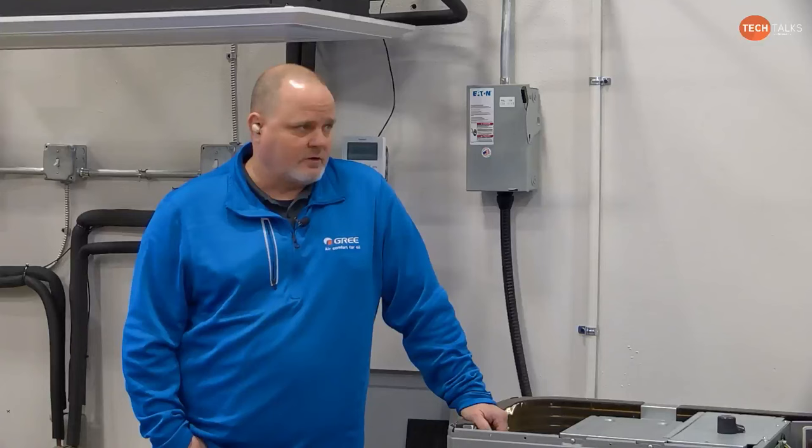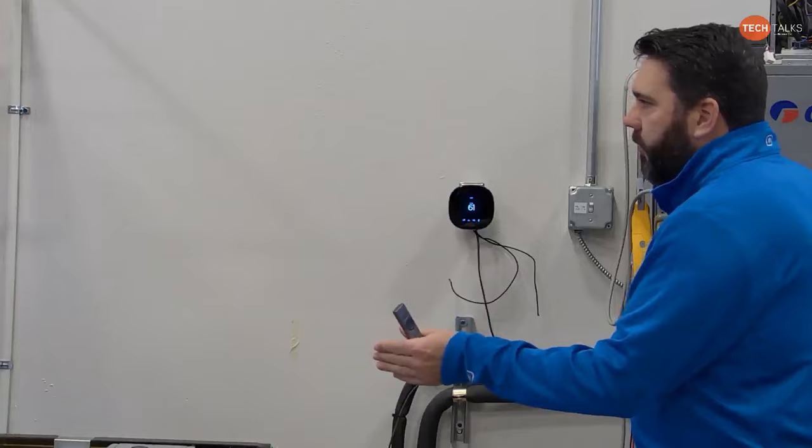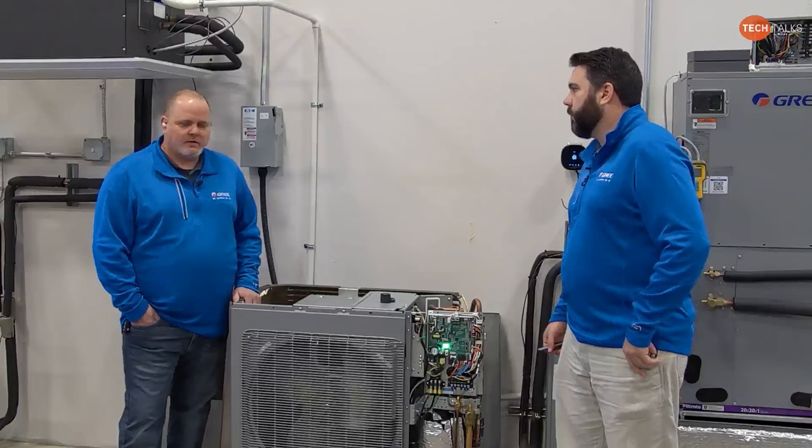That'll help with dehumidification. Yeah, that's a really good point. It'll force longer run times. You want to make sure that your blower is not running too fast as well. So you want to target that 325 versus 350. Make sure that your air is moving slower. I don't even care if it goes down a little. I say 325, but even if you got down around 315, it's fine. I don't think it's going to hurt that machine at all.